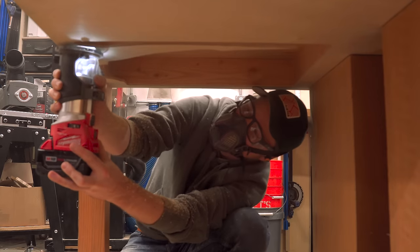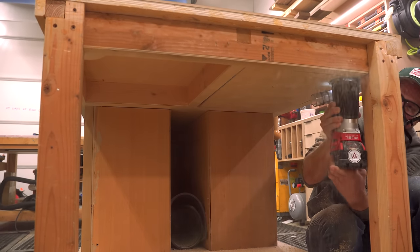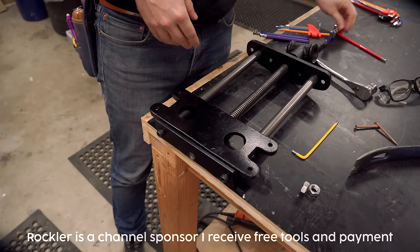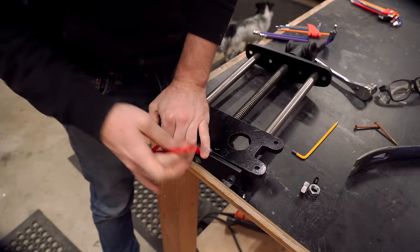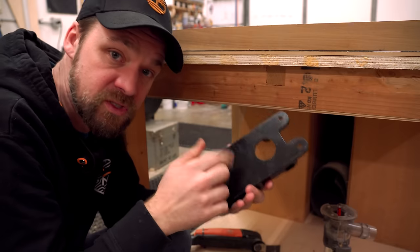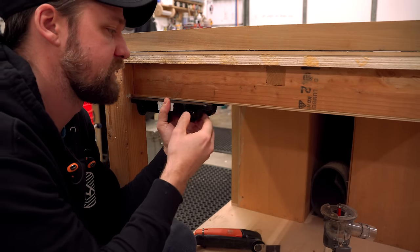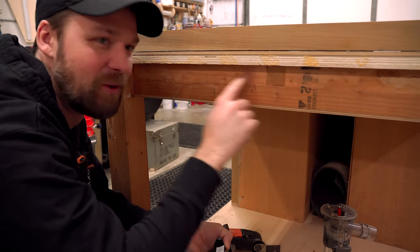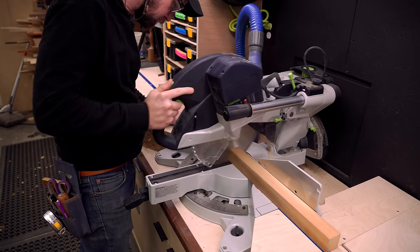Even though the plywood helps with the structure, it became apparent that I had to cut into two of the six bays to make room for the hardware for the vises and to reinforce the bottom for the dog holes. The vises I chose are the Rockler quick release vises — they open after a quarter turn so you don't have to keep turning to loosen. In order to install it I had to take it apart a little. I needed the mounting plate to go a little bit higher, and I also needed more meat for it to grab onto, so I'm going to glue a board of poplar in here and then bolt the plate up to that.